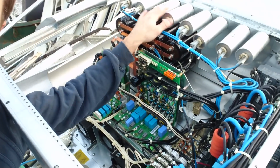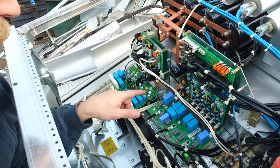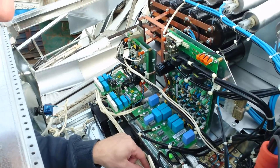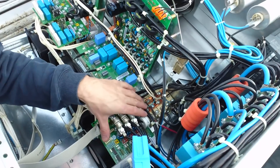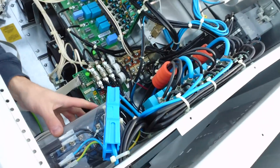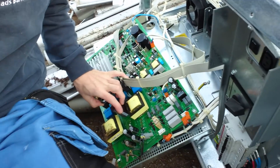As you can see here, there's a nice bank of MKP capacitors, there's electrolytic capacitors, we got some huge IGBT bricks down here — probably SKM200 — and then there is the whole PFC section over here and an input filter section. Some large, nice switches, fans, and a little control board circuitry here.